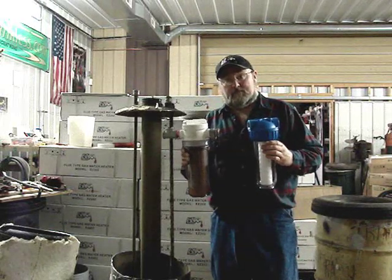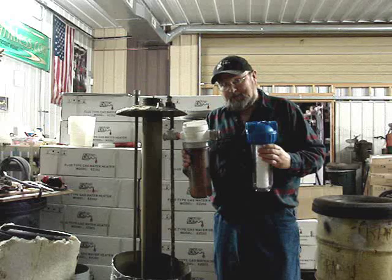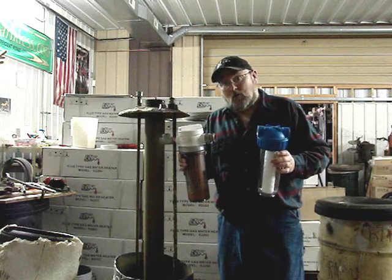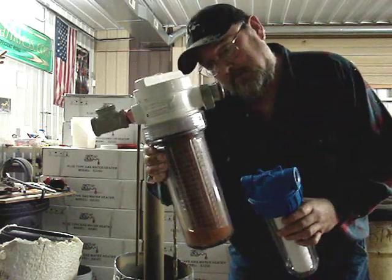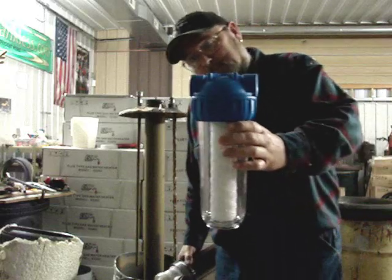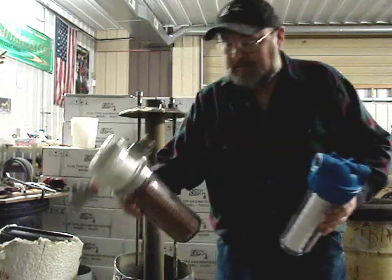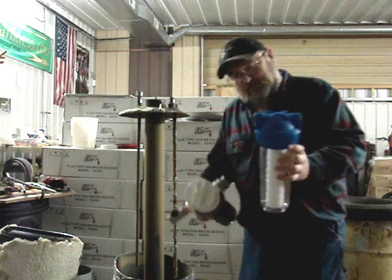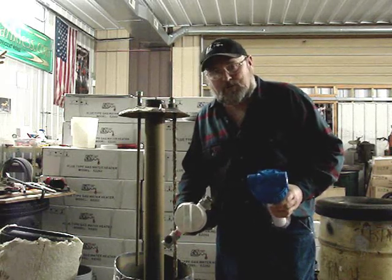Here we have your typical water filter that you would put on the incoming water side of your tankless heater — the cold side — or you would want to filter the water in your whole home. You change it about once a month depending on how dirty your water is. As you can see, it's the same color as the sediments I pulled out of that tank type heater. When new, the filter swells up and gets thick as it saturates when you first turn it on. You can look at the filter through the Lexan lens and then just remove the cartridge and change out the filter periodically. They are not very expensive and are available at home improvement stores and hardware stores nationwide.